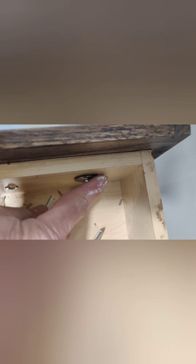What I had to do was add a washer here on the screw because the screw was going through and it was too deep — the screw was too long. There wasn't enough space, so the screw was bottoming out and leaving a tiny gap. You may want to pick up a couple of washers for each drawer.